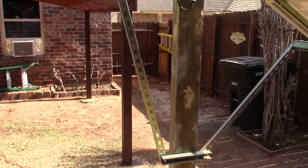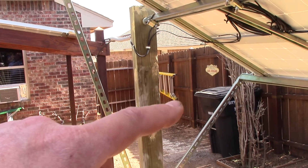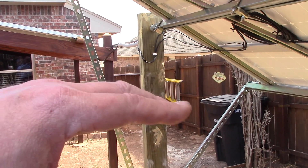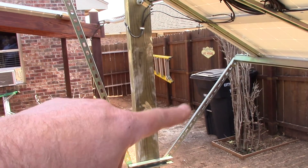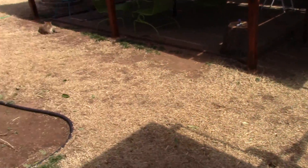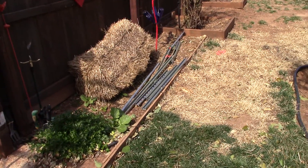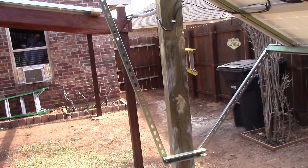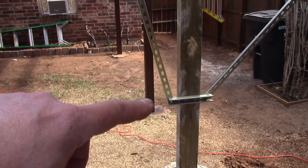What's really cool about this is I can still pivot it and adjust for the angles. Right now I've got it on winter/spring, 32 degrees. And I can adjust this up and reuse the super strut. I have a whole bunch of extra down here so I can just unbolt it twice a year, three times a year, whatever, and adjust it up.